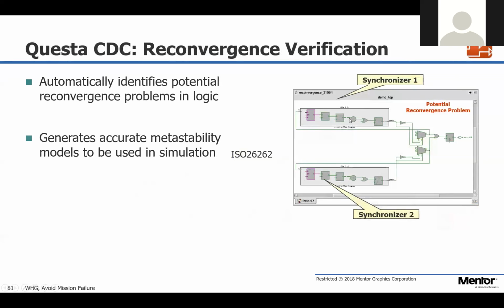But if you look at that, that signal goes through some other combinational logic, goes through some sequential logic, and eventually these two signals come back together through some logic cone. Now, they had some timing relationship with each other back here in the purple domain. And the problem with a synchronizer is that there is unclear timing. It could have plus or minus 1 clock cycle timing difference after it gets through this synchronizer structure. So by the time these two signals come back together into this logic cone, whereas they might have been generated on the same clock cycle back in the purple domain, they could be plus or minus 1 cycle out of phase right here.